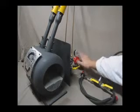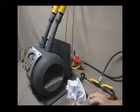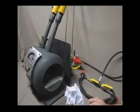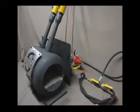Once that is achieved, you would magically produce a piece of crumpled up newspaper, or a cartridge in this case. You would light it outside of your forge, okay? But before you light this, please do a couple of sanity checks. Make sure that you do not smell any gas. If you smell gas, obviously don't light anything.